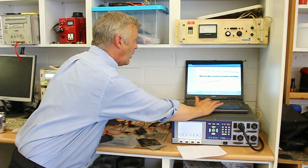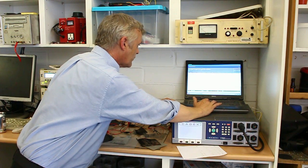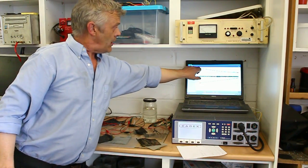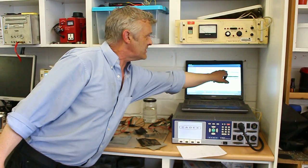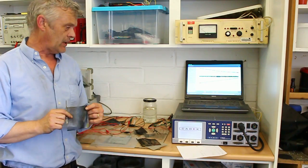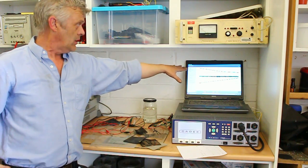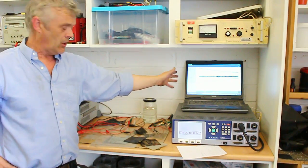Now if we go to the next one, we see a very interesting behaviour in that the battery section, in inverted commas, is extended out here before we get a kind of capacitive fall off, and then it tails out again there. And that's this one here that we're looking at. If we work the math out on that, we actually get roughly 258 watt hours per kilo from that device. But as I say, we're missing the top, we're missing the bottom, but we'll call it 258 watt hours on that one.